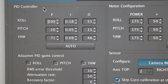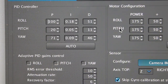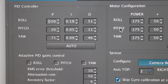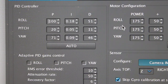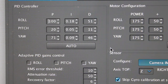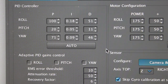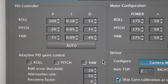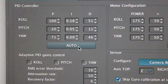The other big area where I spent a lot of time was PID tuning for each of the axes. If you've seen my Tarot gimbal setup, you'll know how much time I spent trying to figure that out. The manual talks you through bumping the PID values up incrementally, finding where it begins to oscillate, and then bringing it back down. In my opinion that is a very tough thing to do, but now with the latest version of Simple BGC you basically get an auto PID setup. Let me demonstrate how that works.